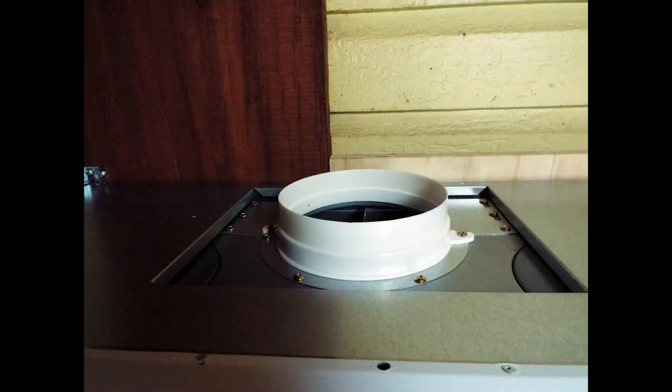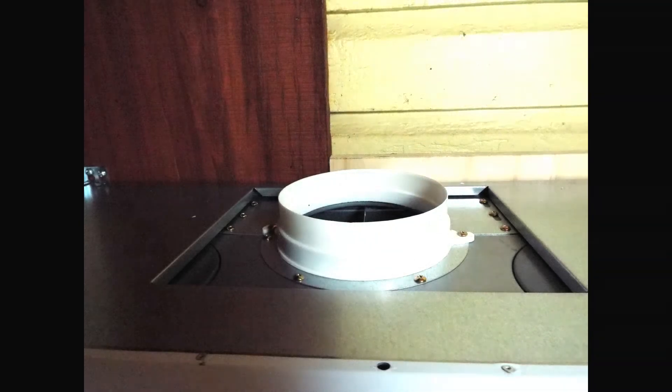Up on top, we locked in the plastic 7-to-6-inch pipe adapter and screwed it in place. Then it was a matter of taking our outside vent from Luxury Metals, putting it on the inside, and marking around it with a pencil — that is where the exhaust is going to go outdoors. On the left side of the white beam is the old outside of the house, which is now inside and backs up against the pantry. On the right side is outdoors, so that is the only place we could put the exhaust.